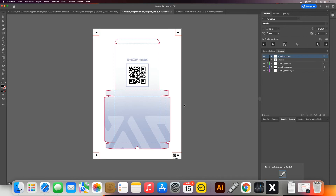This is much more efficient if you have a job of, say, 50 boxes you want to cut and you can't print the marks on the back. Just first cut all the holes one after each other from the USB thumb drive — for example, I have a file called marks.plt which will cut my marks. Then after that, when you have your batch of material, put them all in from the back side and cut the actual file one after the other. That gives you a lot more efficiency.